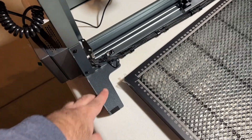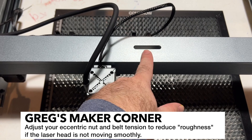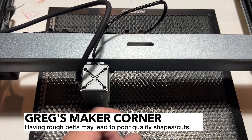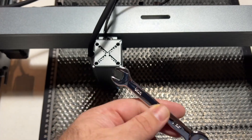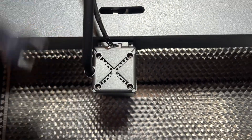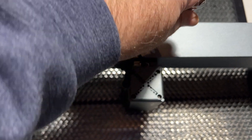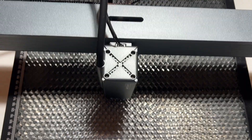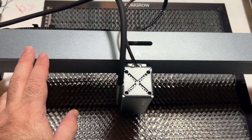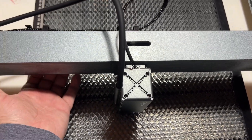I'm noticing that this is really rough and there are dips when I move the head. I'm going to adjust the eccentric nut on this to make sure I've got smoother travel, because if I don't I'm probably going to have some mistakes in my laser engraving or cutting. Ateser did include this wrench that we're going to use — you just insert it in here with your head centered, and this is where you tighten or loosen it using the bigger side. I'll experiment to figure out the right setting. I turned it a little and it seems better, but there are still some rough spots. I think the actual problem is the belt tension, so I'm going to flip it over and adjust that. My Y-axis is very smooth, but the belts are extremely tight on the X.